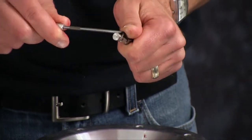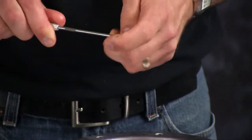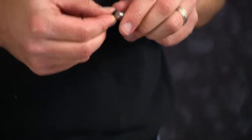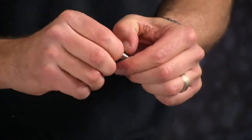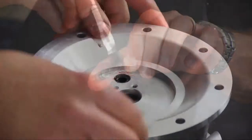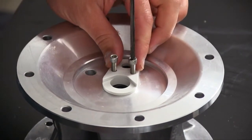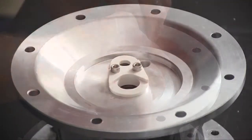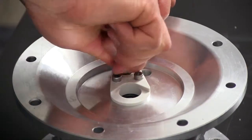Go ahead and remove the old O-rings from the pilot spool and discard. Once the old O-rings have been removed, inspect the pilot spool for any wear or scratching, and install the new O-rings. Leave one bumper O-ring off for installation purposes. Apply grease to the pilot spool O-rings to ensure they don't catch, bind, or cut while assembling into the pilot sleeve. Set aside and now install our main shaft retainer plate — repeat this process on the opposite side. Once our retainer plates are installed, we're ready to insert our pilot spool. Slowly insert until we don't damage, roll, or nick any O-rings. Notice that the bumper O-ring on the opposite side will need to be installed.